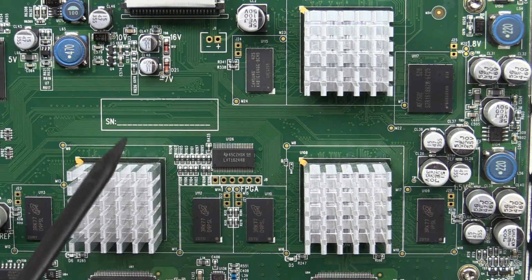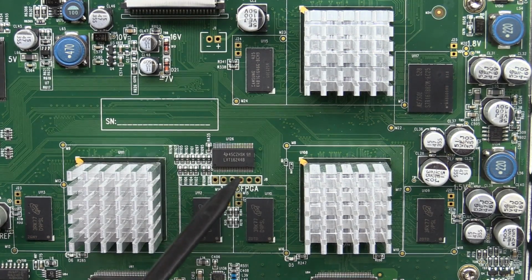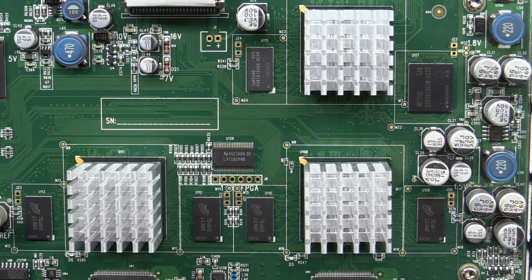And just in case you weren't convinced that these three are FPGAs and Siglent have leveled up and they're designing their own ASICs now, well, look, dead giveaway, FPGA, there's our JTAG header, and they've only got the one here, so that'd be daisy chaining all three, which is very common. So what have they got under there? I don't know. Xilinx or Altera? Who knows? I'm not going to go to the effort to hook up a JTAG boundary scan thing and actually get the IDs out of them.